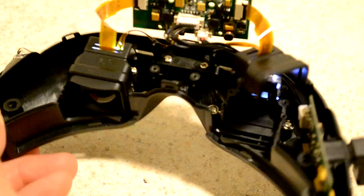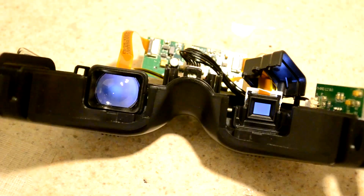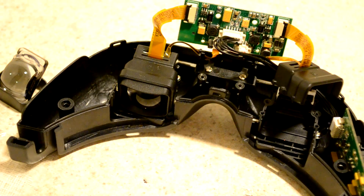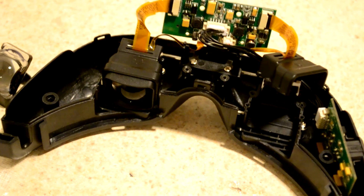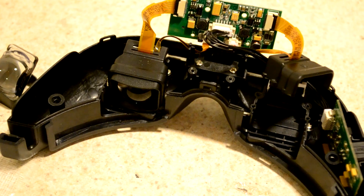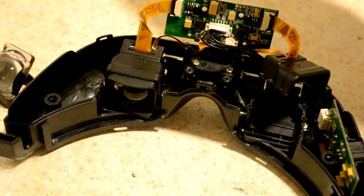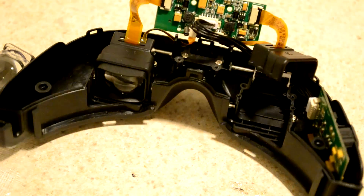Fat Sharks are actually very simple devices. This is one without a radio receiver, so it's more simple than the one with a radio receiver, obviously. This is the Fat Shark Base SD — it sells for $250, I believe. And that's really all it is: two independent LCDs connected to an image control circuit and an analog decoder.